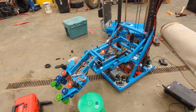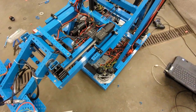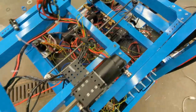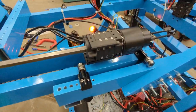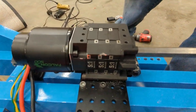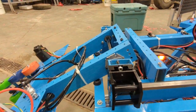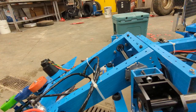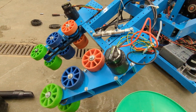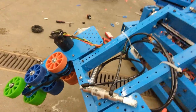On a Sunday, got everything sloppily wired but functional. Oh, what a mess. We have a Falcon with a 125 to 1 shaft drive to a 90 degree, and that is our wrist to make it go up and down. We have two Falcons running our wheels in and out, and two 1-inch pneumatic cylinders to clamp.